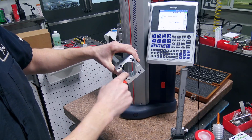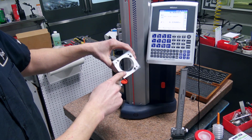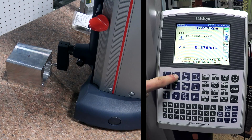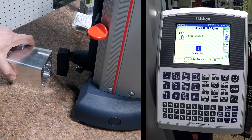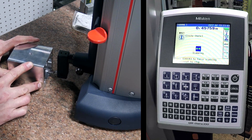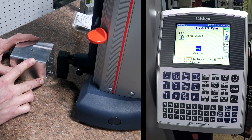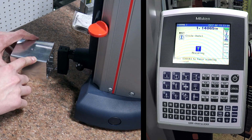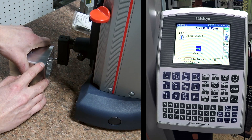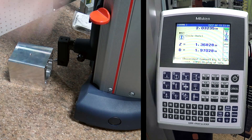I'm pretty confident in the bore diameter number right here - 1.97. But I think there's too much runout back here. Let's just try it. We push the inside diameter button, it comes down, it beeps. Now carefully push it across - it's finding the low spot, beeps when it comes back up high enough. It finds the top. Awesome - two to three tenths over. I like that.